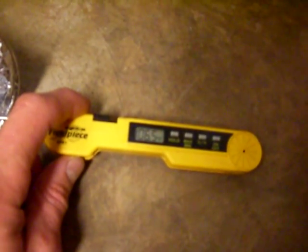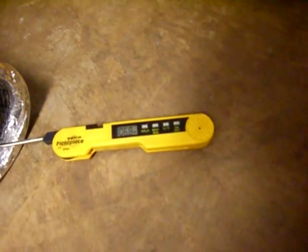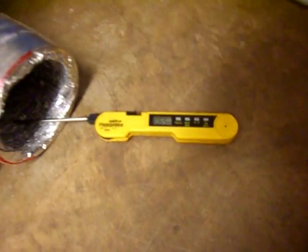Now we're at 105.4, 105.8 — yeah, about 106 degrees and coming up. You just had to get that water in the coil and then it's got to transfer to air. That's good enough to dry clothes. I had 30 degrees of temperature difference just a little while ago when the water was hotter, and I turned the Johnson control up a little bit more.